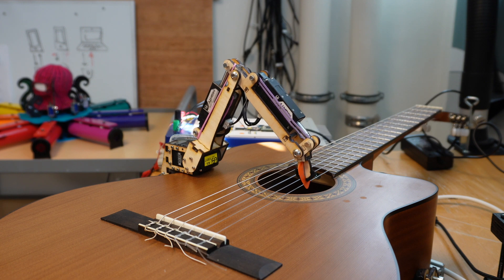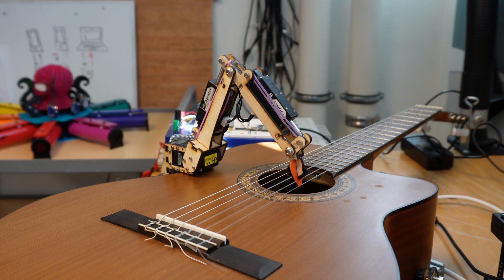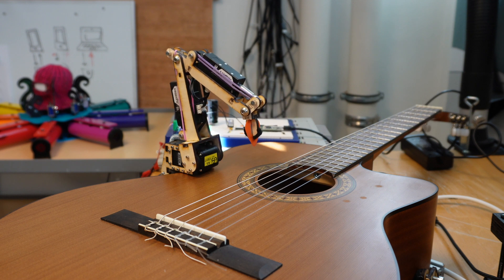What's interesting about rapid plucks is that as soon as I send the first command the finger starts moving, and then while it's still moving I send the second command before the robot has plucked the first time. That implies the second pluck is going to have to be scheduled sometime in the future. What's interesting is figuring out when — where — that pluck is supposed to be scheduled, because there's not going to be enough time for the robot to pluck the first time, move all the way back to resting position, and then all the way back to the string again. Somehow the second pluck needs to interrupt the first or be spliced into the movement that's already been planned. Anyway, here is what that sounds like.